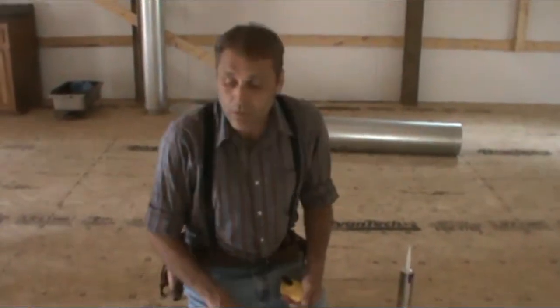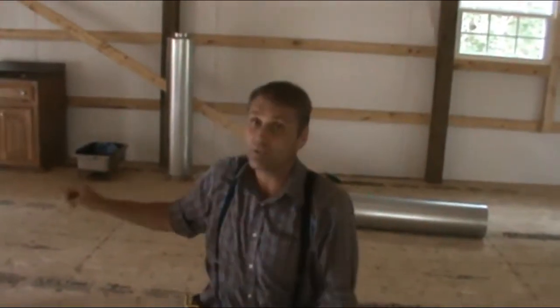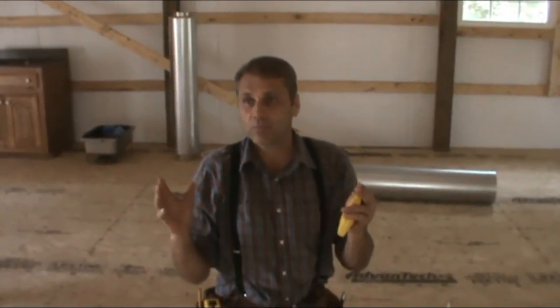We had ordered a chimney kit, which you can see is back there. Now, the chimney kits, they will sell together everything that you will need from the ceiling to the exterior. That was what was in the kit that we ordered. Now, we ordered the triple wall galvanized. The triple wall is to make sure that the heat will dissipate upward rather than outward and cause fire damage or burning of anything in your attic or on your roof.